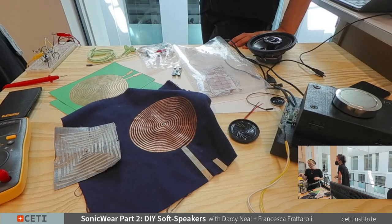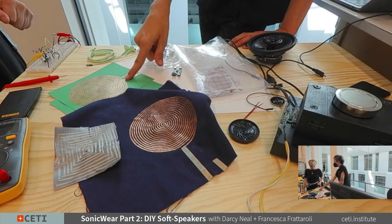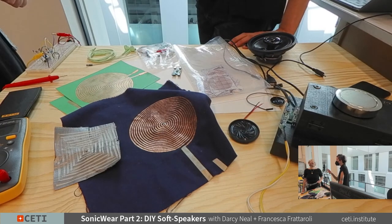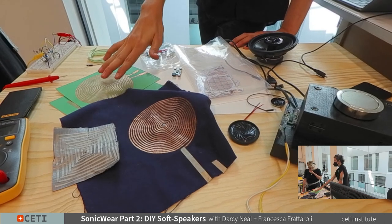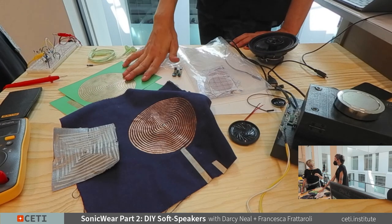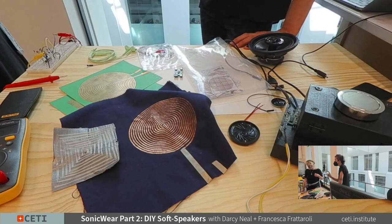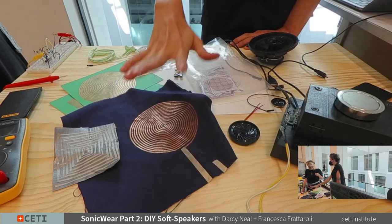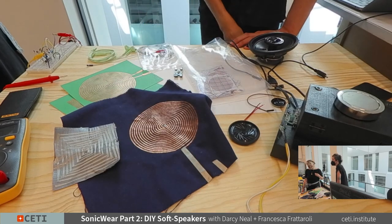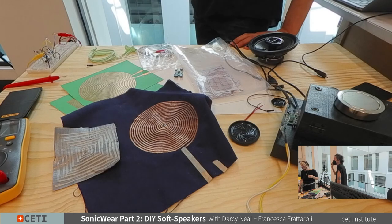Totally. Those are great. It's going to be much louder with the exciter. You could stick this on there, but you're going to want to put an insulative layer in between so that it doesn't short out through the metal surface. That could even be a clear spray paint as an isolated layer, or tape, or fabric with some spray adhesive. Maybe even a thick enamel coating, because you also don't want that interface medium to get in the way.